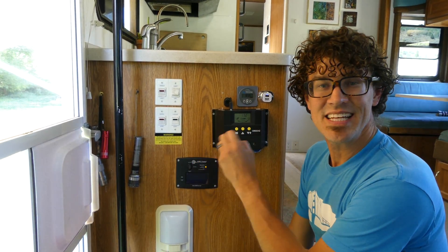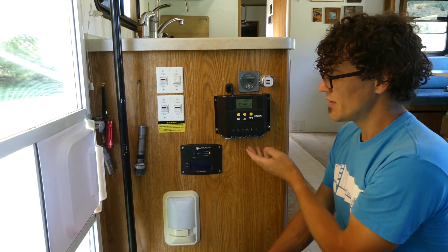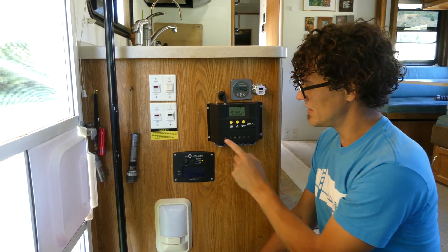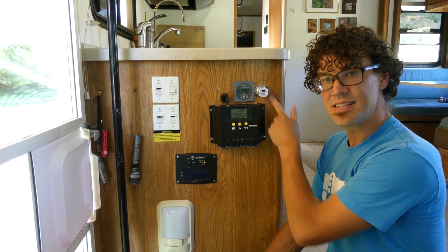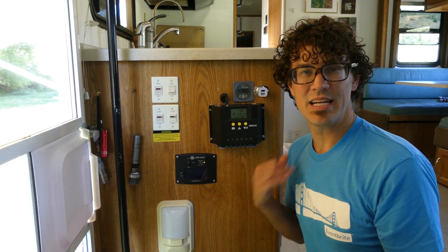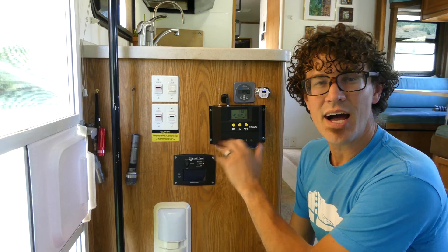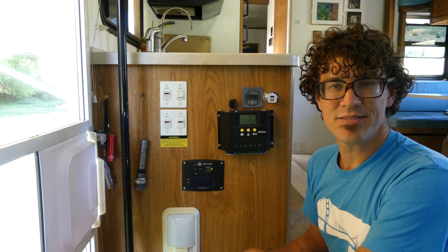The upside of this is it was very inexpensive. Another pro of this controller is it has this load output — you can put whatever you want on that. You can put a light bulb. We ended up putting a 12 volt socket on there. This just takes whatever little extra energy is left over and puts it straight out to this instead of to the batteries. So this gives us a nice 12 volt outlet that we can use right here in the kitchen. The downside of this controller is that it's PWM instead of MPPT, so we're definitely not taking full advantage of all the power that our solar panels are putting out. In the end, we decided it was the right price and it really suited our needs.